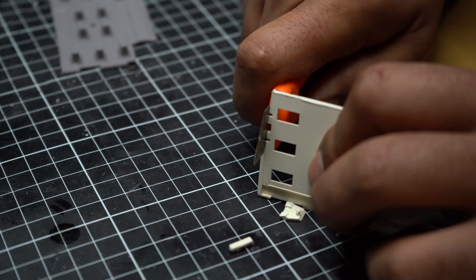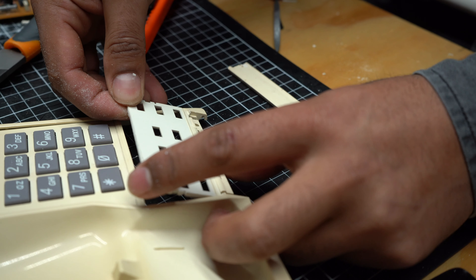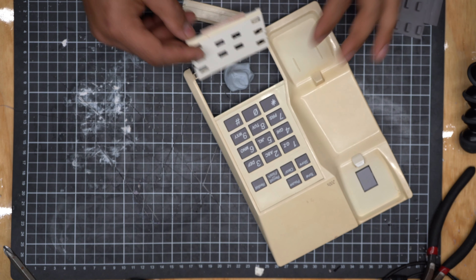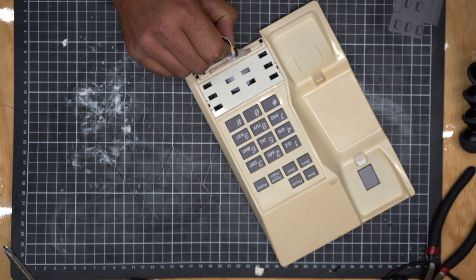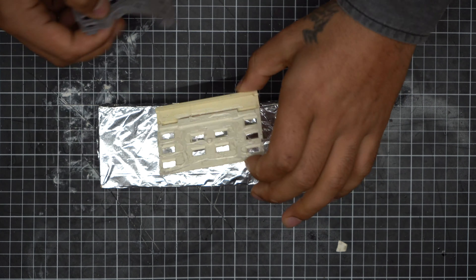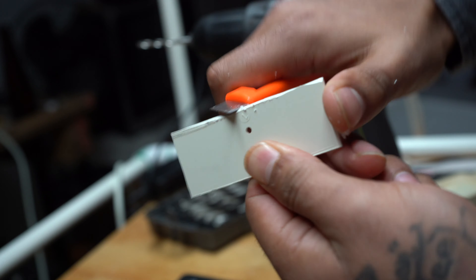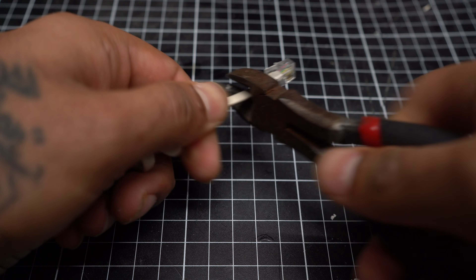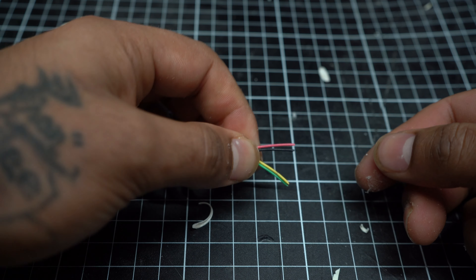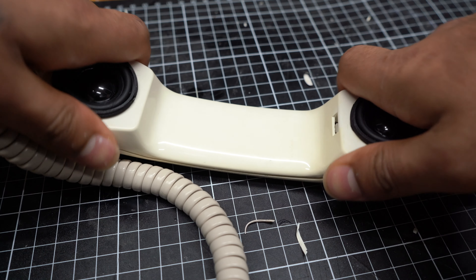There was a bit of cutting and fine-tuning involved with these little moving parts, just because I needed clearance to make sure it sits flush. The small piece in the background actually has a hinge on it already, so I'm super gluing some of these little parts together, dry-fitting first, and then gluing while it's on the chassis so I know it's going to sit flush. The next section is a backing board where I'm going to put the buttons, and also little notches for the cables. Broke my heart to do this, but in the name of art the show must go on — and I rewired this little thing with very little space for my fingers, but we got there in the end.